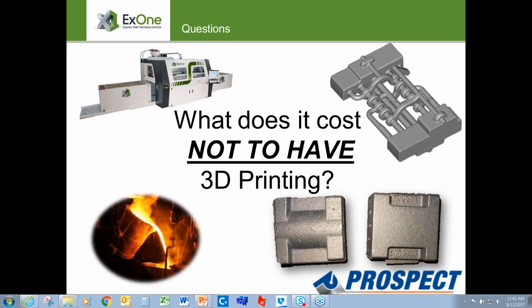Well, on our ordering process, we found that at first we used to order 200 at a time. And the first time we ordered 1,000 pieces, we had them sitting around for 4 weeks. And the last run, we had some scrap. It was higher than we'd had in any of the previous runs. And we thought it might have traced back to the cores sitting around for too long, but eventually we realized it was a problem with the molding machine. And so I think we've gone back to that where we order, and typically our cores will sit here. They have a shelf life here before we run them of 2 to 4 weeks. But I imagine they would probably go a lot longer than that.